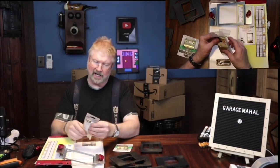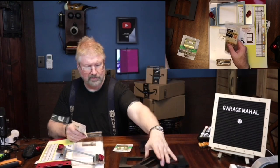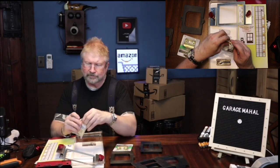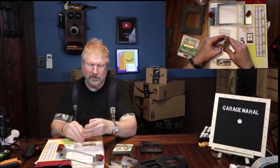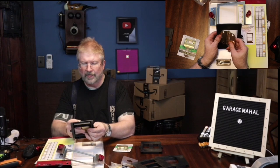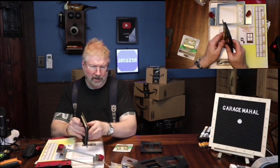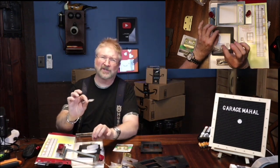And this will also fit into this template so you can line it up on your door frame. So we're going to be using that one. And then we have a three-inch door hinge. This is your three-inch door hinge. I'll just kind of open it up so you can take a look. So that is your door hinge and it fits perfectly in here. So when we are beveling out, you can see what a nice fit it's going to make inside the door. It does come with a router bit and some screws to help put the jig down into your piece of wood.